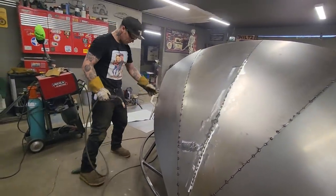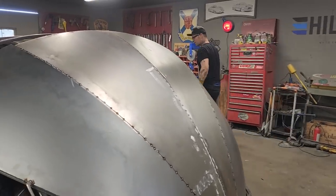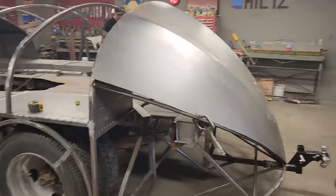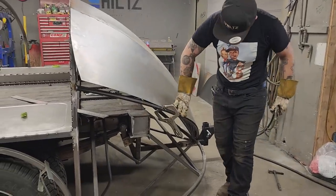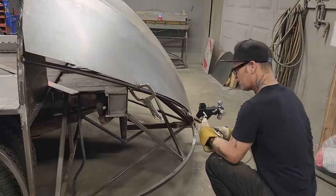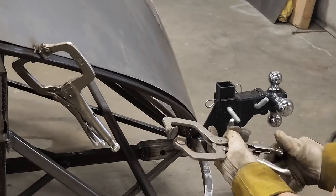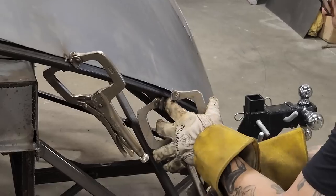All right, we got that on there. Get a pair of pliers, put the side on there. We're at the middle on that, I'm hoping, or close to it. That way it runs better. If I got too much metal somewhere, it's not in the middle, but if it was in the middle, it's better. If you get a bunch of metal at one end and not at the other end, then you end up with the puckering situation and you have to shrink it. I don't want to shrink it if I don't have to.